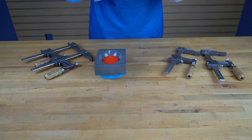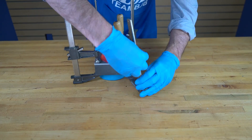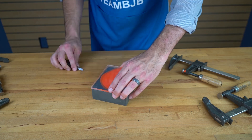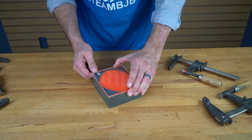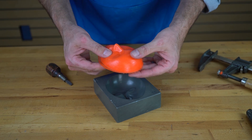Because of its rigidity and strength, molds made with TC1630 work well for expanding foams. BJB's polyfoams create high internal pressures as the mold fills, and creating back pressure is essential in creating consistent cell structure and overall finished quality.